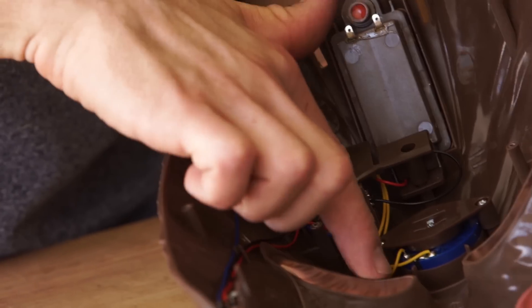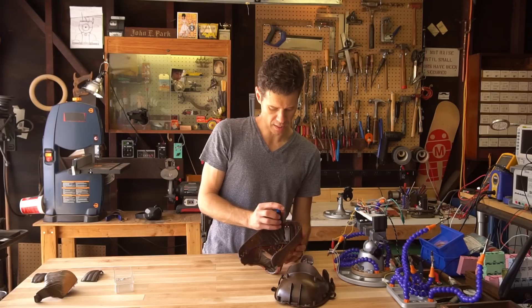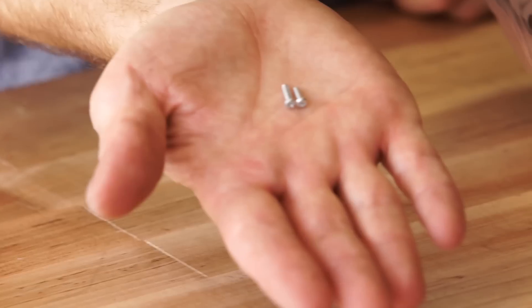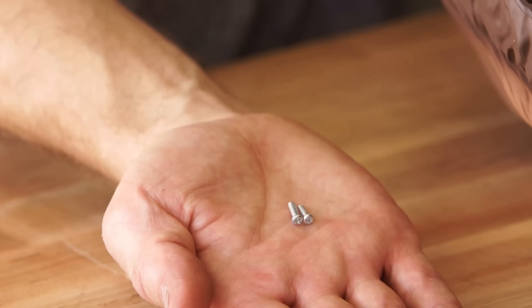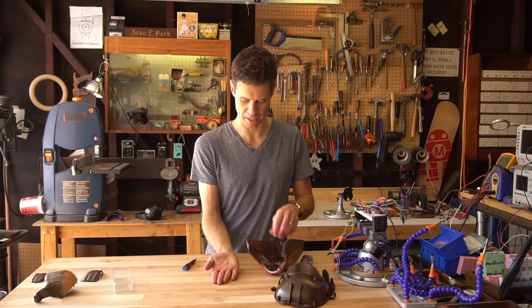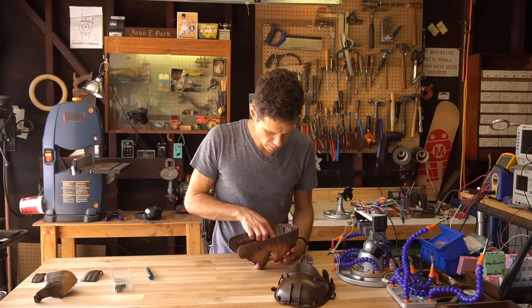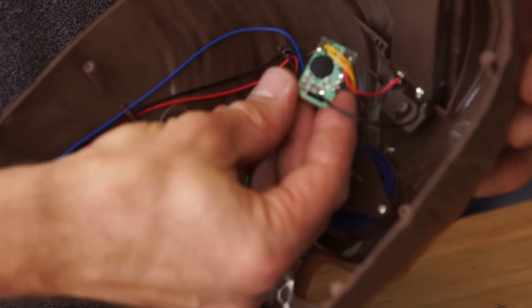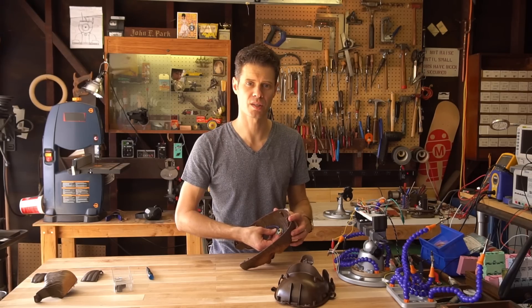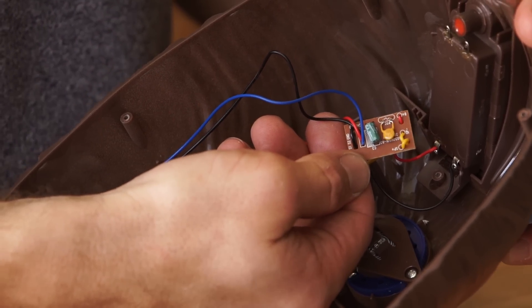So this here is the speaker — got a couple of yellow wires running up to this area as well. I mentioned earlier that we want to save one slightly different size screw. That little shorter screw is the one we're going to keep track of for placing this center bracket post back in place later. That's actually where we're going to put our own new circuit. Pull out this little piece of plastic and now I can see the circuit board that runs the whole operation. There's a little blob of epoxy there that's covering up whatever the chip is that's holding the sound effects, and then we've got the circuitry for amplification of the sound effect and regulating the power.